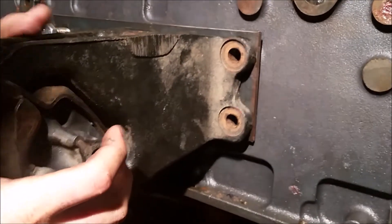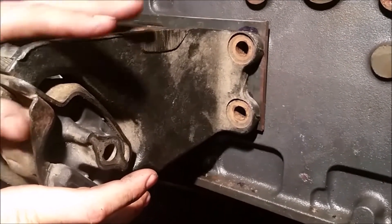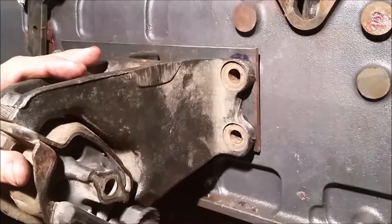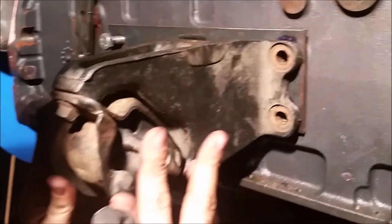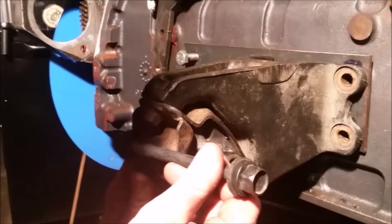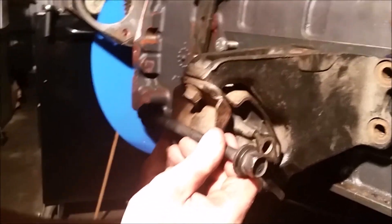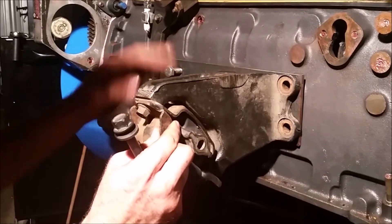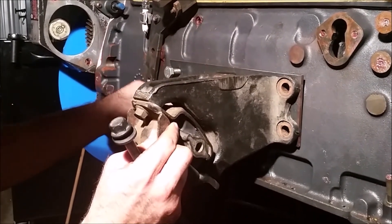This is carrying all the weight, so you'll do that on both sides. After having done this, the cradles will stick out a quarter of an inch more. When you stick your motor mount bolt through, the two ears that stick up — you're gonna have to grind those out just a little bit, a quarter of an inch, so the bolt will sit down in a new channel to make up for that quarter inch spacer. That's all the modification you'll have to do for your common rail swap using this style of motor mount plate — quarter inch plate steel with M12 1.75 bolts.